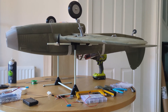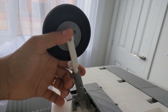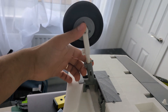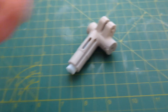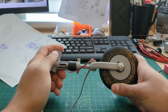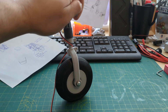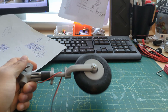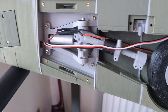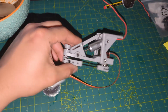One more thing before the test flight: I resolved one of the key issues with my 3D printed landing gear design — the rough interface surface between the upper and lower leg as it compresses for shock absorption, a natural consequence of 3D printing. I resolved it by using PTFE tubing to line the interior of the shock. This completely eliminated the noise and it feels so much smoother. Of all the design work in this project, these landing gear — and particularly this new iteration — are the thing I'm most proud of.